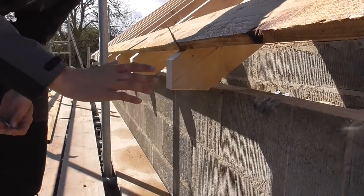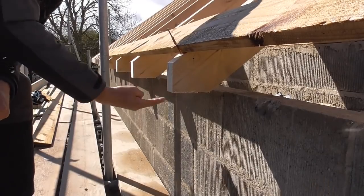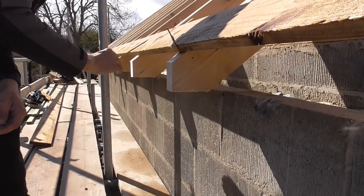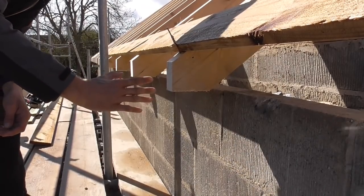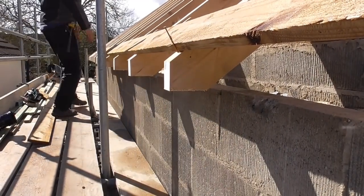Right, hopefully I'll be able to show you just what I've done. The bottom of these rafter feet are cut off at more or less the right place to allow the soffit to go through. What I've done at the other end — you might be able to see — is I've just tacked a little bit of batten across just to hold the other end of this 6x1 that I'm going to put on. And what I'll do now is show you how I put it on and line it up with that level. Right, let's get the level.